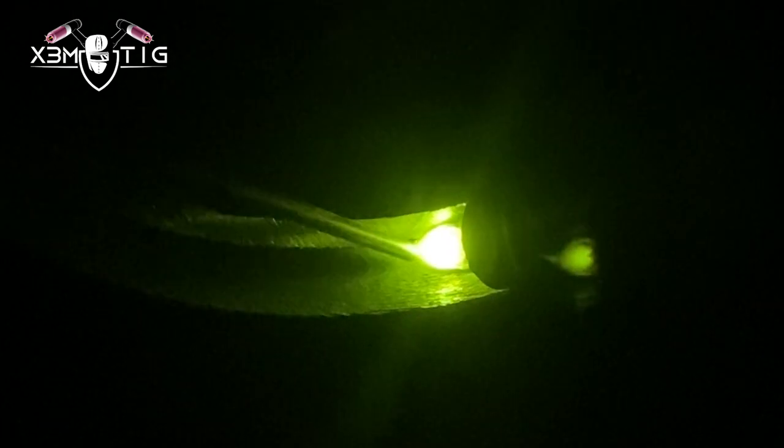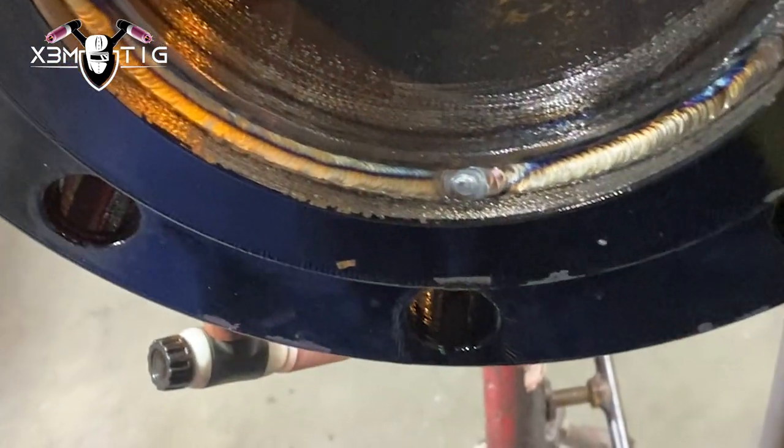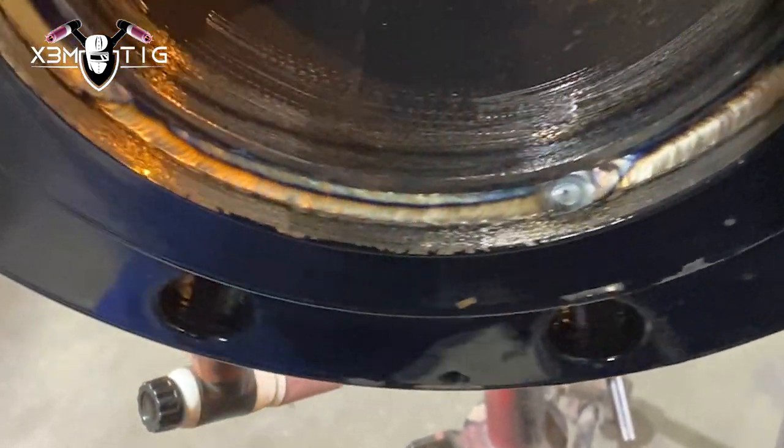For the second pass I'll go a little bit wider. Slip-on flanges are mainly used for fluids at low pressure or with little risk of leakage. It's very common to find these flanges in cooling water lines, firefighting water lines — this is one example — low pressure compressed air lines, and process lines for substances such as steam, oil, gas, condensate, etc.